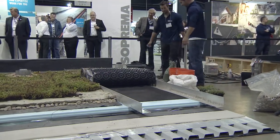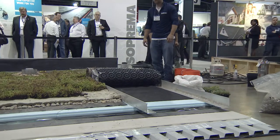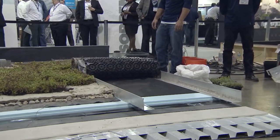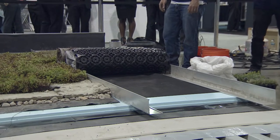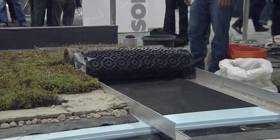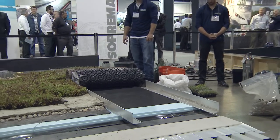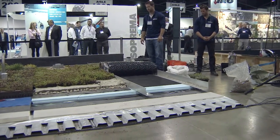Built-in-place systems feature uninterrupted drainage layers and an engineered growing medium. They are easy to install without heavy tools — all layers are easy to cut with a utility knife and each product is sized for ease of manual installation. The layered approach allows installation in phases: certain layers can be installed later in the building process to avoid damage to vegetation. On an inverted roof, the green roof can be used as ballast to keep the insulation down — using the soil of the green roof system as ballast — with vegetation installed later in the process.